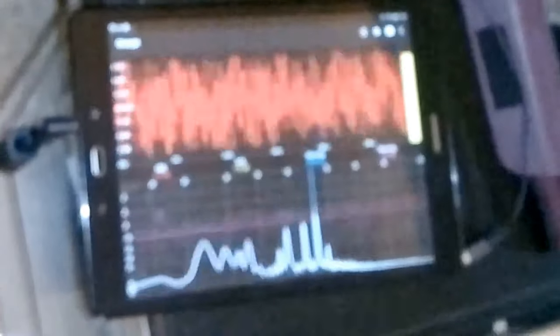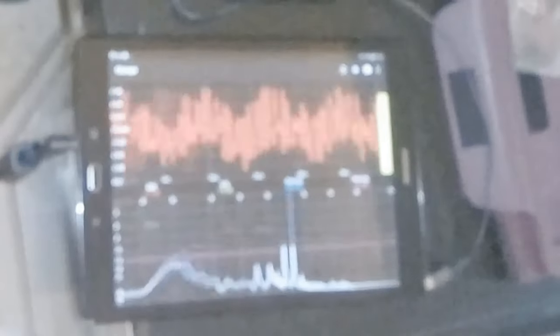It's gone muddy. I'm doing this voiceover because of the problems of copyright. If I turn it back — this is a proper music cassette. When we're looking at this trace, what you're looking at is the high frequencies, which is to the right-hand side of the screen. You can see quite clearly how it's all trimmed. This is one of those adjustments where you have to go up to the point and then pass, then bring it back until you actually get to the peak. I'll go further and start losing it again.